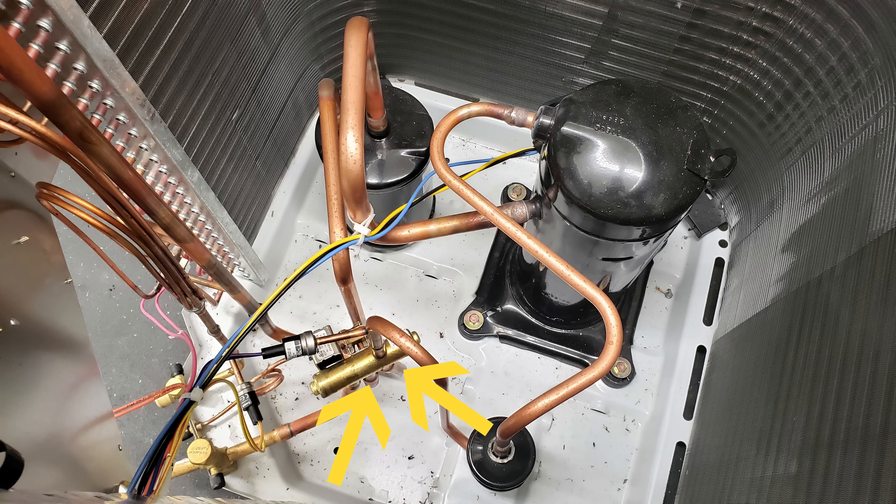At the same time, the bottom lower right tubes are connected, and so the outdoor coil acts as the evaporator in heating mode — you're absorbing heat from the outdoor air into the refrigerant. The refrigerant travels into the reversing valve on the bottom lower right, which connects over to the center tube, then goes to the accumulator and into the compressor. If you want to learn more about the refrigeration cycle of a heat pump in heating and AC mode, check out the videos linked in the description and our book on pages 27 to 32.